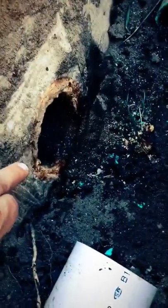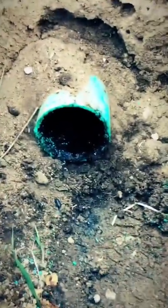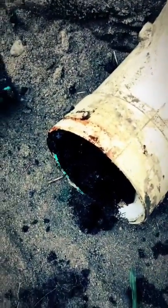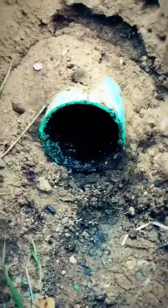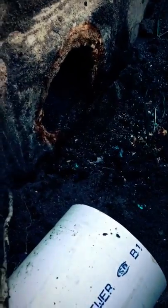So now we've separated the outlet pipe, and that's all the biomat that was coming back from the field. We had quite a bit of blockage. Here's the pipe that we cut out — as you can see, a lot of biomat buildup. It was clogging that whole outlet area leading out to the field as well. All of that was really clogged up so it wasn't going anywhere. Now we're going to hook back up so we can get that effluent into the field.